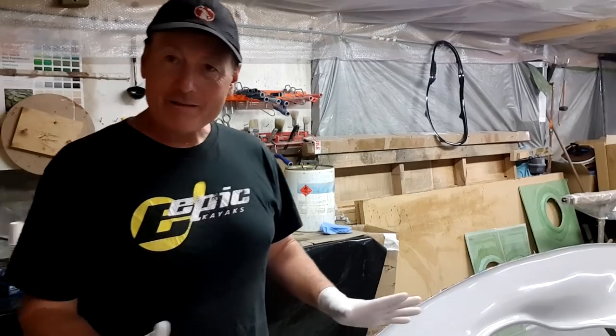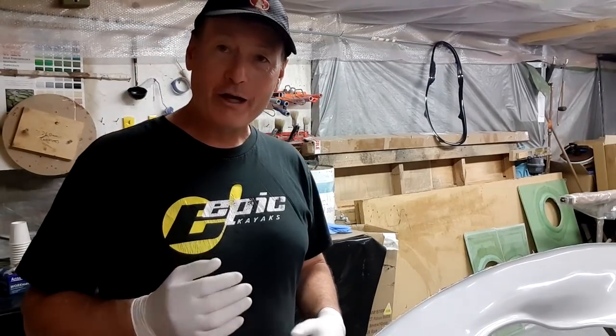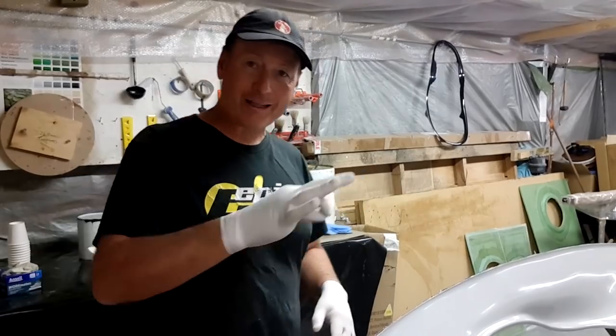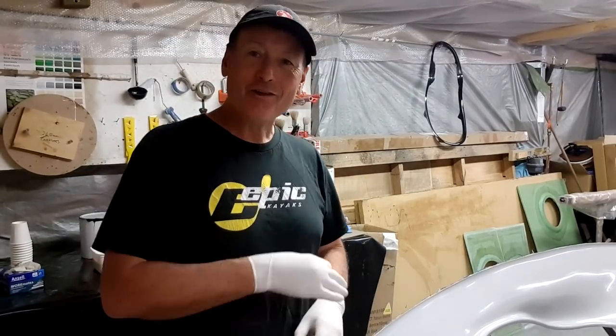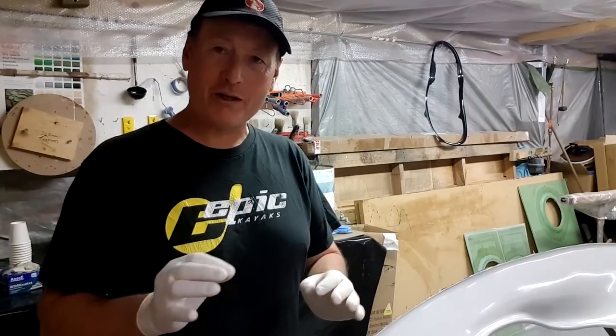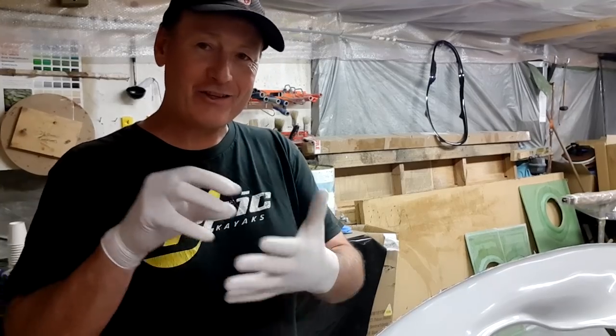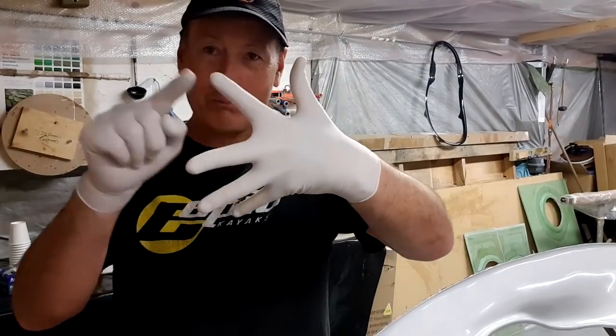Okay, before I begin, this mould is now ready to go. I'm going to use black gel coat as the first colour. So I'm going to be trickling that, splattering it, throwing it in all different directions all over this mould. But I don't want to put it in massive sections, because I need to be able to interdisperse. Let's say that's all my black streaks.